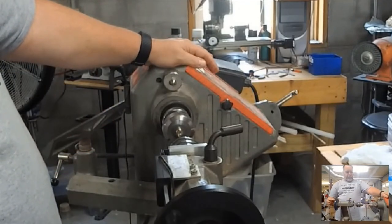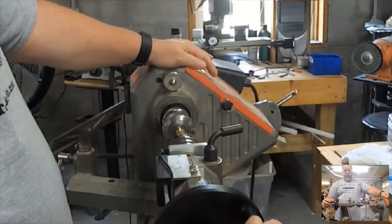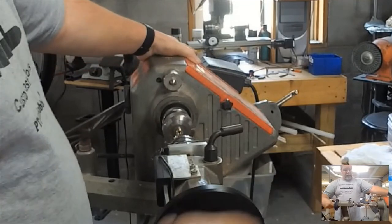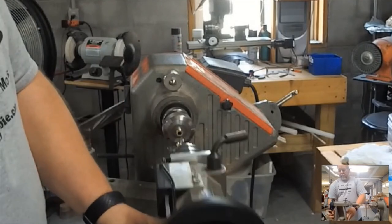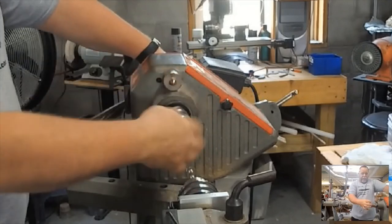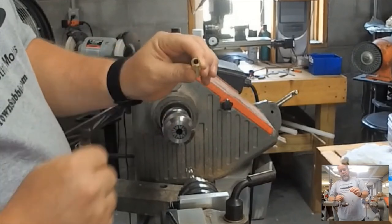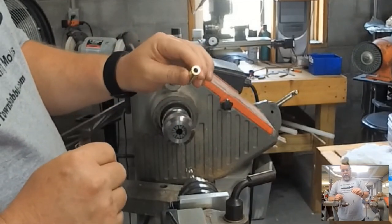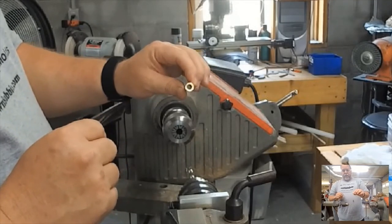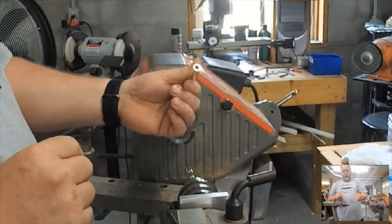For the second casing, slowly advance — make sure your drill bit is sharp. We're through — back out before you move your tail stock away. Take out the casing and there you go: you have a seven-millimeter hole in your casing that will now accept a seven-millimeter tube and a seven-millimeter transmission.